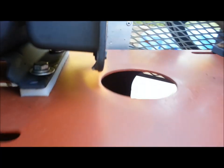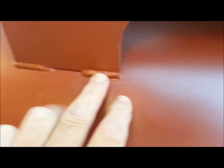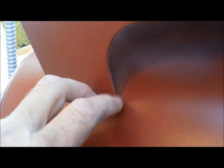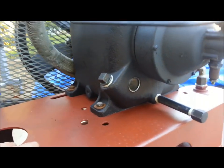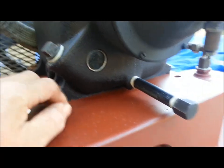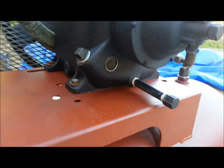I'm hoping that eliminates some of that vibration and cracking and fatiguing of this top plate. This weld here I actually redid - I ground it out and redid it because it was starting to show signs of a crack. The top plate is thinner metal, and I can attribute that crack to the vibration of the pump and motor assembly. The oil leak is non-existent now with a little bit of teflon tape. We ran it for a while yesterday and changed the oil - got a lot of sludge out.